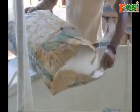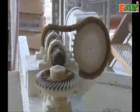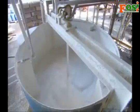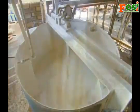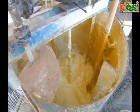While at a separate vat, workers add powdered lime to water, preparing a solution to which they will then add the juice. An agitator mixes the cane juice and lime solution for about six hours to complete a process called alkalization. It regulates the juice's pH level and helps clarify it. In reaction to the lime, the juice's color changes from brown to yellow.